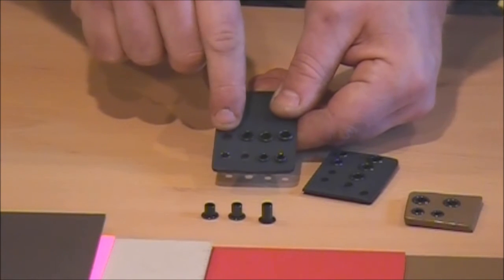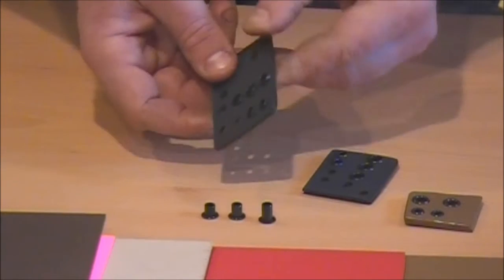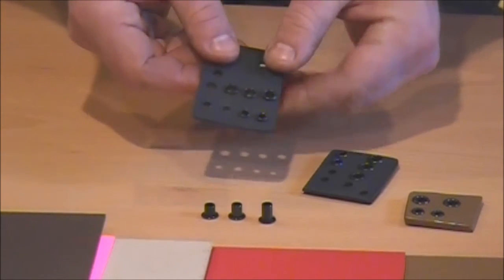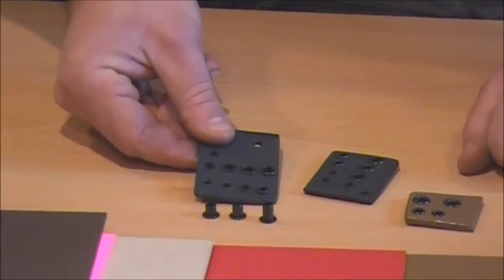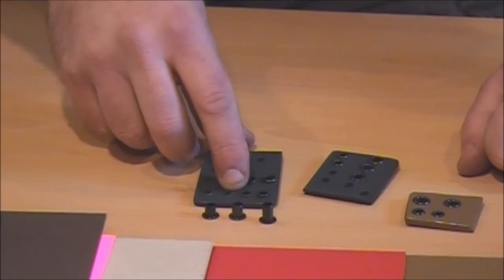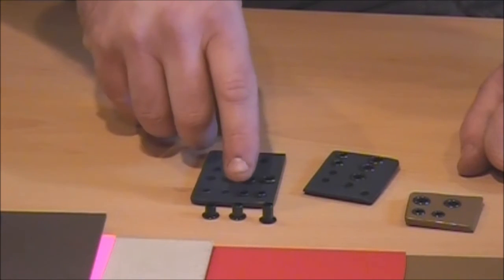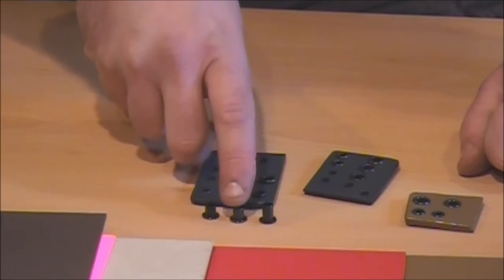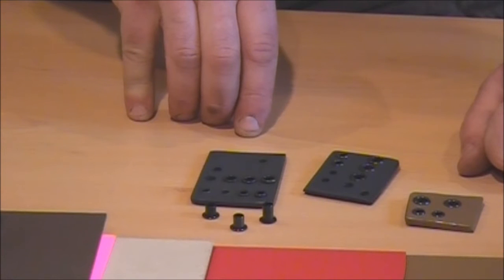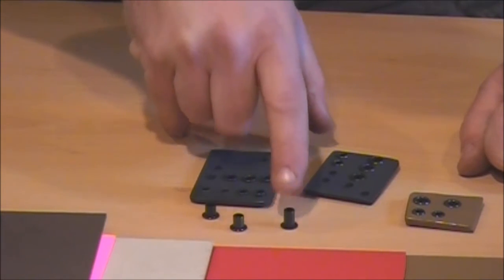There isn't one available for the 1/4 inch, but as I say, you can use all of the thicknesses on anything thinner. And if you're going to invest in this equipment, it's not cheap. I would recommend that most people would be fine with the 93 thou thickness in 1/4 inch if you're only going to invest in one. This will do all the thinner sizes, and you're unlikely to ever need the thicker one.